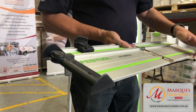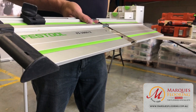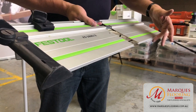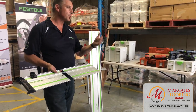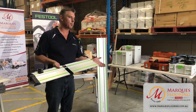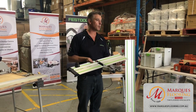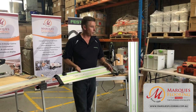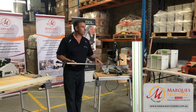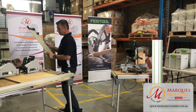The splinter guard is a wear point — it will always wear, especially if you change to a thicker blade, which will eat into the strip. If you notice splintering or chip-out, you may need to replace the splinter guard strip. You can buy that strip in 1400mm or 5 metre lengths — just peel off the old one, clean the edge, and add new splinter guard.